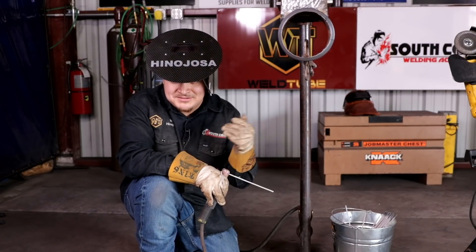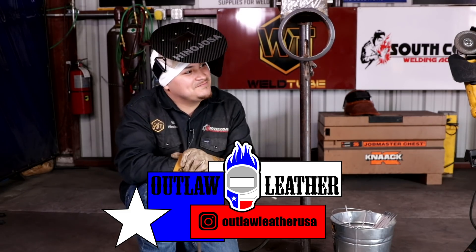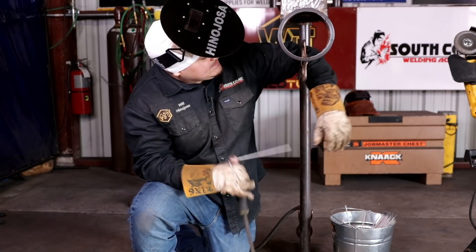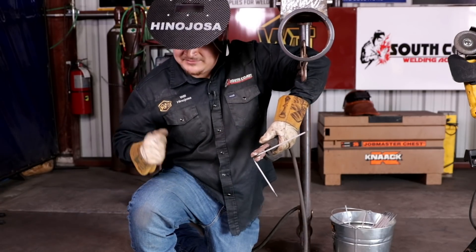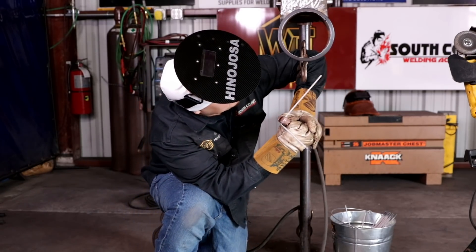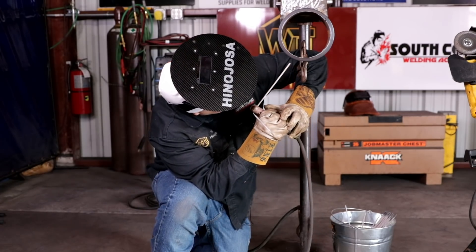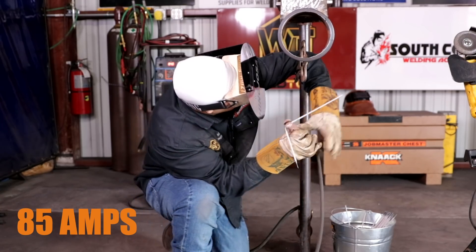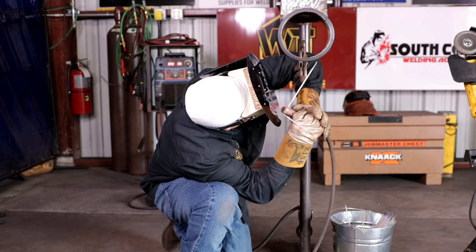Before we start, I want to give a quick shout out to Outlaw Leather for this nice carbon fiber pancake — I use it every time I weld sticks. I'm going to use the inner part of my elbow to hold my weight. Also, prop your right leg up — or if you're left-handed, vice versa — because this allows me to hold my weight and gives me better stability. I'm burning at 85 amps, that's where I like to run my 7018 — no hotter, nothing less. 85 amps. Here we go.